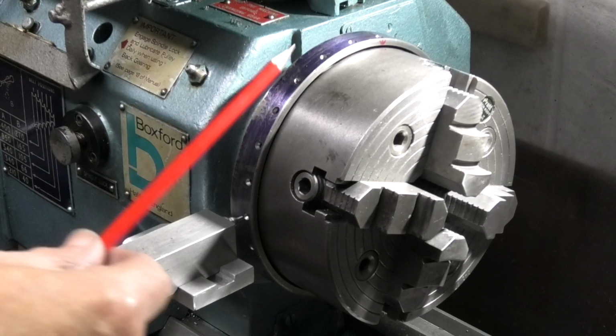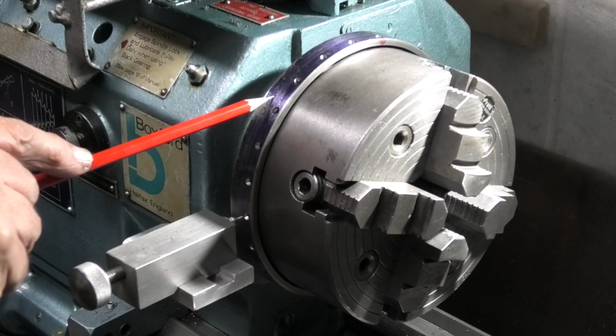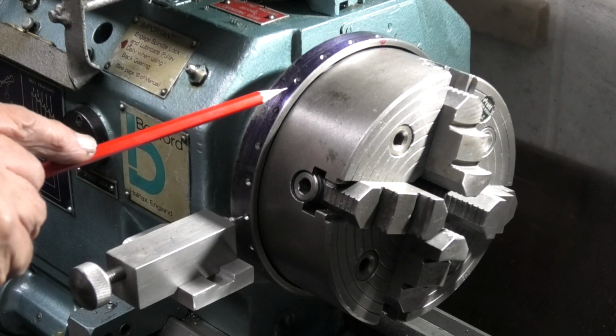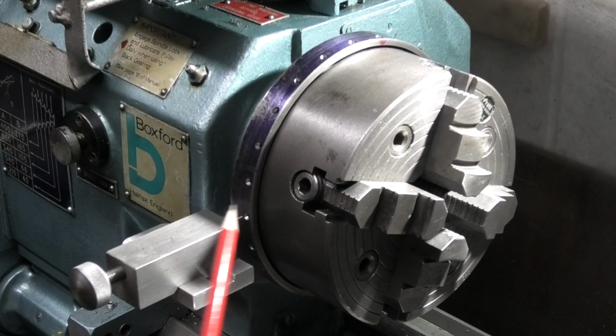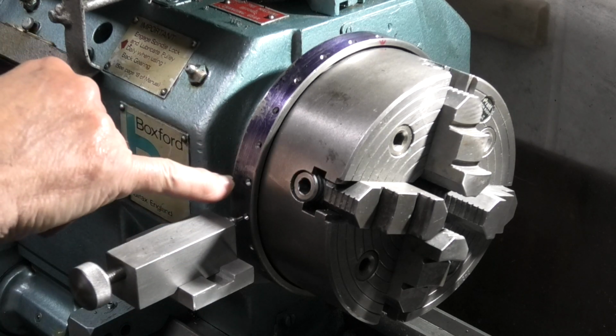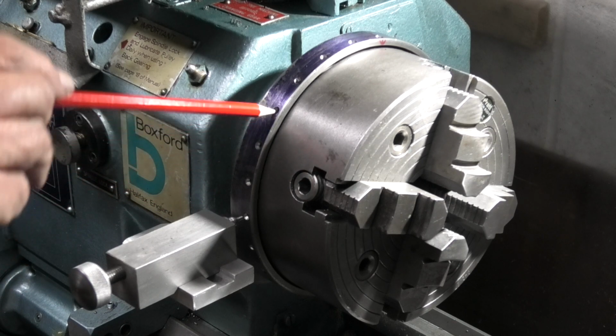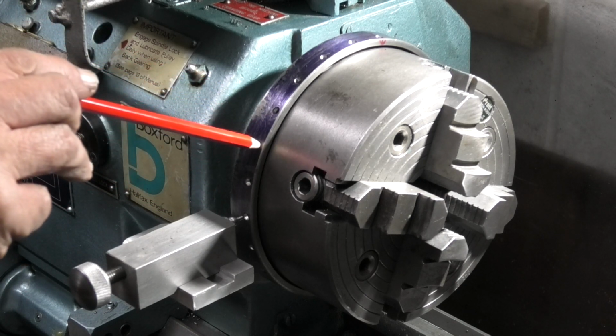So this is my 4-jaw chuck. On the back of that I've added my indexing ring, which is made from a car brake disc. There's a video on my channel to see how I made that. This arm is just bolted to 2 holes in the headstock. They're already drilled and tapped, so you just bolt this arm on, and then this has a plunger that goes into the hole, whichever hole you select. That locks the chuck.